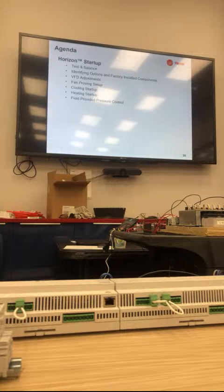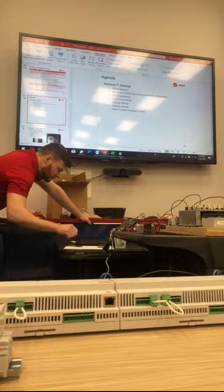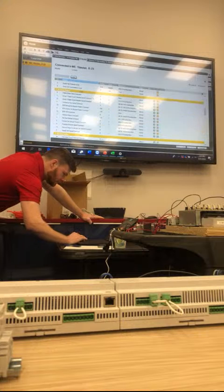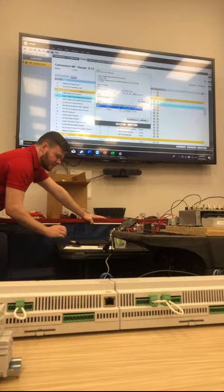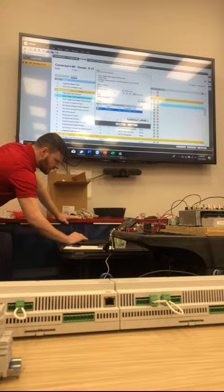Right, I also have a question about circuit 1 digital scroll variable speed command overridden to 100%. I see that a lot. Why would that default to overridden? On the one that I uploaded last night, the very first override is front panel, does not expire. I've seen this in TU on some of the ones that I've done, and I can't do anything with it. I can't stop it from being up there. It doesn't seem like it affects it. Is it this right here where it shows it has an alarm and the cooling? I'm looking at it on the TD7.